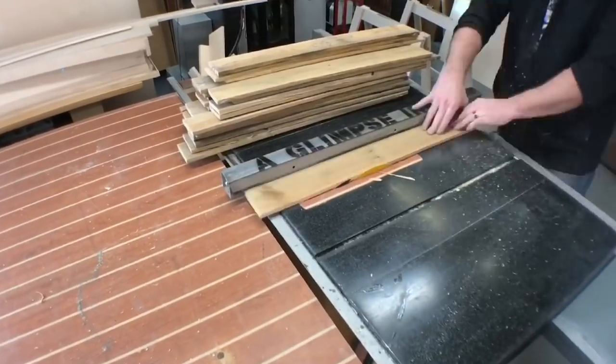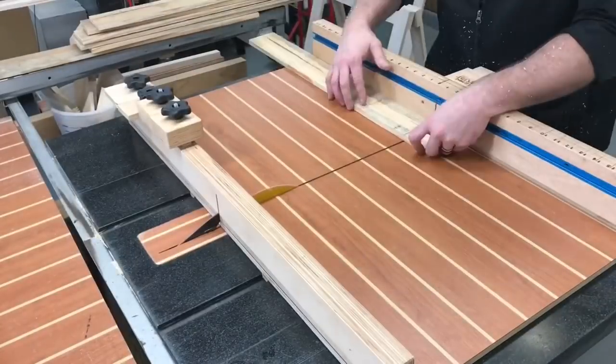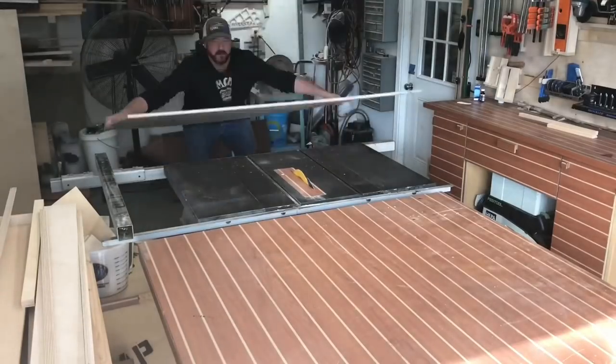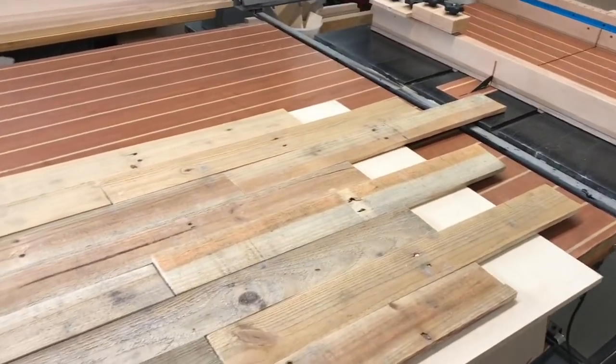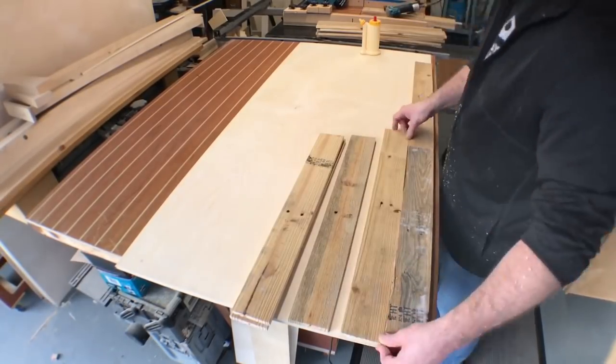With the pieces disassembled, I have some nails to contend with. I'm gonna trim these off with an angle grinder, because I want the other side to keep some of the nail heads to maintain that rustic look. I then clean up each edge and cut these down to a size that gives me a chaotic, brick-like hardwood floor pattern. This half-inch piece of Baltic birch is going to be the substrate, and I like the pattern so far — let's nail it down with glue and brads.